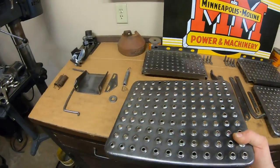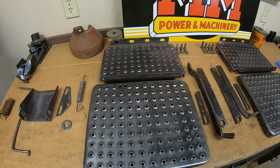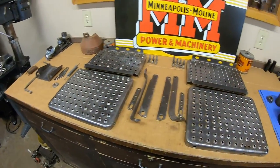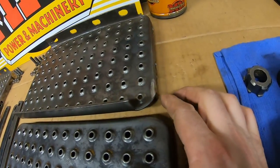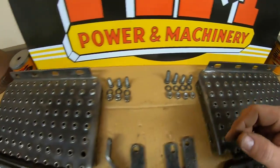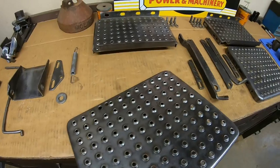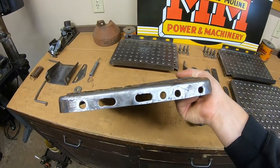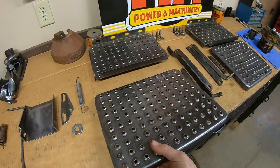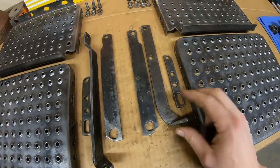Okay, everybody, finally, I've got them all flattened back out and fixed back up. So yeah, a lot of tweaking, a lot of straightening had to happen, and I had to do some crack repair. I V'd out, welded, and flushed a crack right there, another one right there, another one right there. And so the whole front of this one, that's the one that was all pulled out and damaged. I closed up all of those open holes and renewed the slots and got everything rounded back out, looking good. We've got the braces in much better shape than they were.